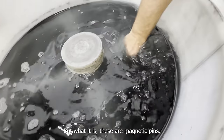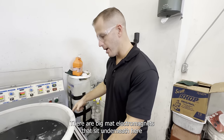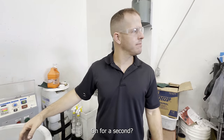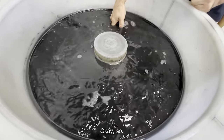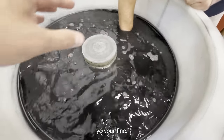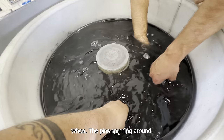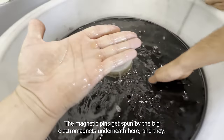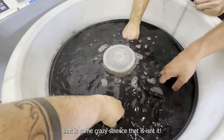There's more metal in there. These are magnetic pins — big electromagnets sit underneath and spin around in a circle. When you turn it on, you can see it tumbles the parts around. You can actually feel the pins spinning. The magnetic pins get spun by the big electromagnets underneath, and they just act as a little abrasive to deburr the parts. That is crazy science.